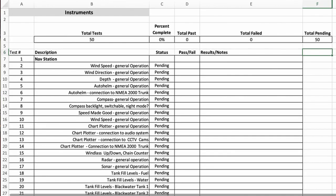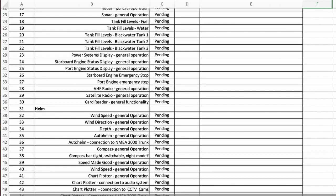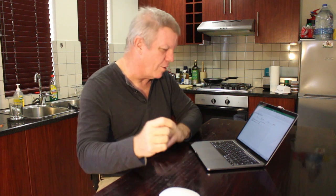For instrumentation, the test plan has one section for the nav station and one for the helm. Make a list of all the instruments you'll have and verify they can all function. For spares, compile a list — or work with the manufacturer — to make sure you have extras of everything likely to fail: filters, engine belts, spare relay switches. They're also working with their boat's manufacturer to get a small amount of each paint used on the boat, so if minor touch-ups are needed they have the original paint.